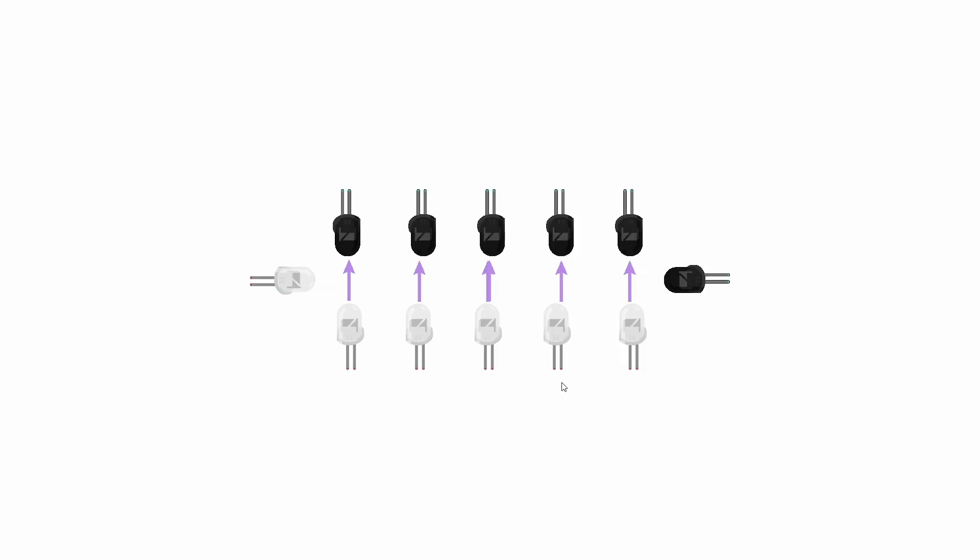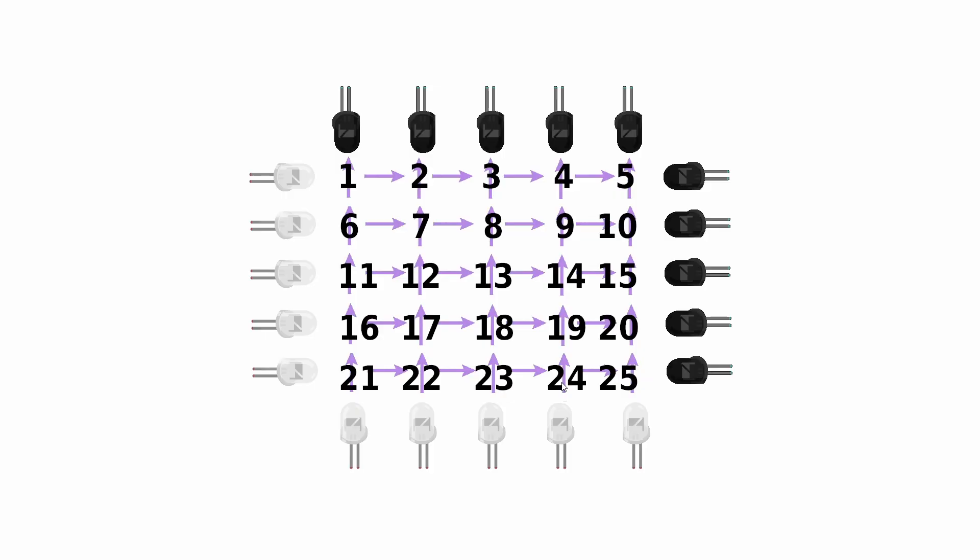Just by chance, I was watching a short and came across a signal analyzer from the 80s. It had a touch screen that used light beams around the edge, because capacitive touch wasn't available back then. You cross the beams and it determines exactly where you're pointing on the screen. The beam shoots upward from the width axis, and adding the signal going across gives us our button matrix — and again, this is just 5 buttons for the price of 6 inputs. We can expand this out just like we did with the copper tape and get our 25 buttons.